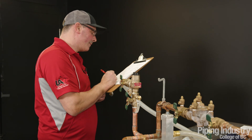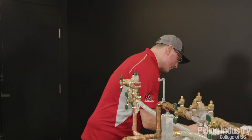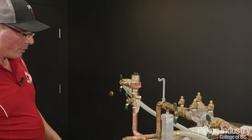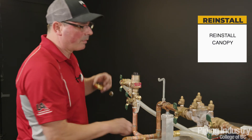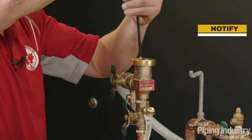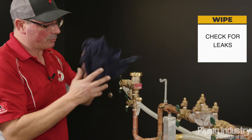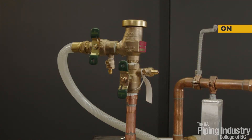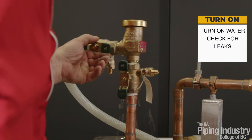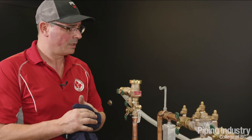Okay, that's a pass. The check valve is holding tight. I'm going to sign my paperwork and make sure my test cocks are closed — everything's looking good. I'm going to replace the cap. It's always a good idea to ask permission to turn the water back on. I can quickly check for leaks, give it a good wipe down, make sure we've got no drips and none of the test cocks are leaking — everything's holding nice and tight. Ask permission to turn the water back on and then we should be good to go. Thank you very much for watching the video, hopefully this is helpful, and we'll see you next time.